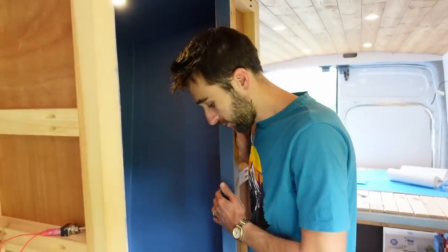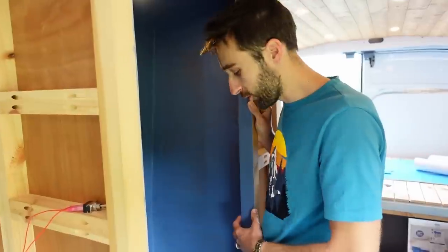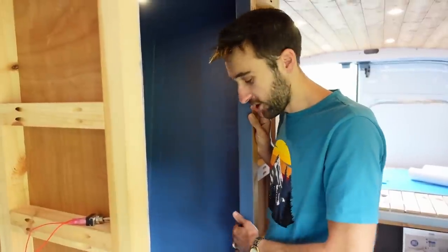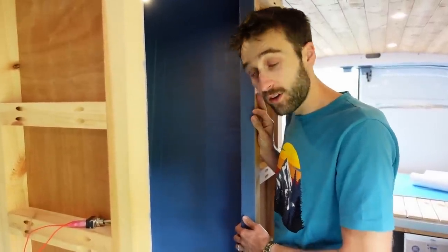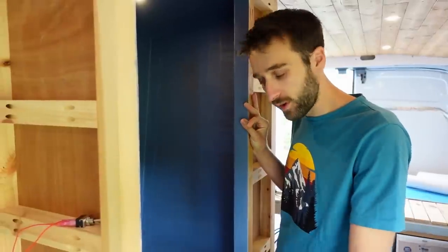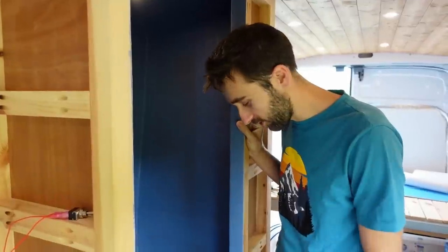So the PVC layer we're about to put in, and also the outer flooring, should make a watertight seal anyway, but it's quite nice to know that underneath, it's still watertight just from the tanking kit. So pretty good, and this should also be flex resistant, so as we're moving down the road, with all the vibrations and things, hopefully, fingers crossed, it'll stay watertight and we won't have water starting to come into the van.